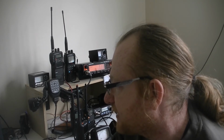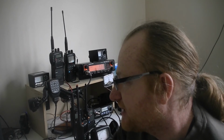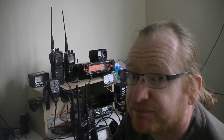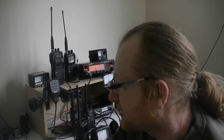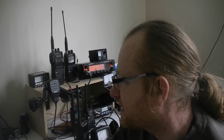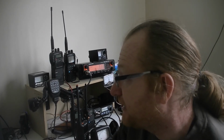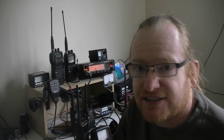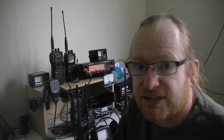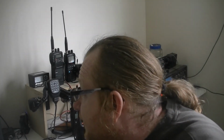And it'll give you links to listings for voice repeaters, analog voice, digital voice, simplex gateways, and packet stations, which would be APRS. So we're not interested in the APRS bit, we're only interested in voice repeaters, which could be analog voice like GB3IR and GB3HG, even though the latter does actually run a Yaesu DR1X repeater from what I understand, which is a System Fusion repeater, but they have that function disabled, and they don't have the NOV for it.